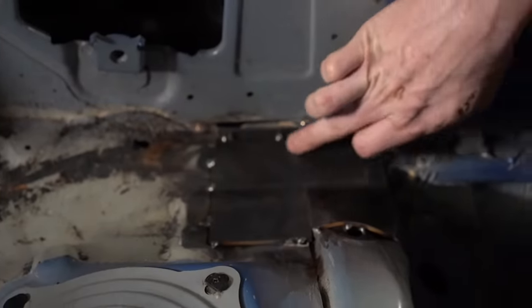Okay, so to finish off the base plates, we're going to be showing you what we're going to be doing here for our 7th and 8th point of this roll cage. It's an 8 point roll cage. So we're actually going to be having intrusion tubes going through the firewall here, where we're going to bore a hole, and then the tube is the final landing spot. It's going to be right here on the strut tower.